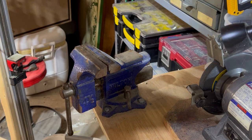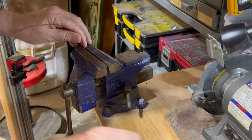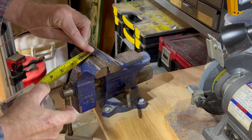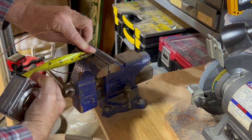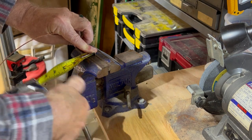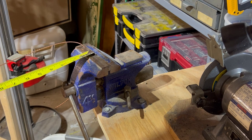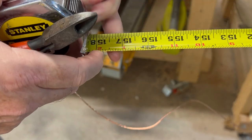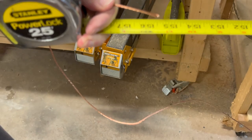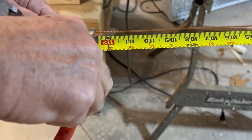The way I plan to measure each one, I'm going to take about six or eight inches and put it in my bench vise, then clamp my tape measure and walk it out to measure. 12 feet 11 inches for the 17-meter elements, and 9 feet 4.5 inches for the 12-meter elements.